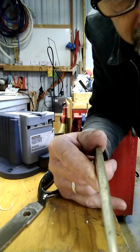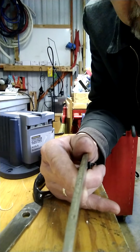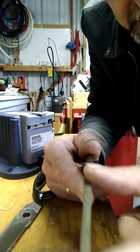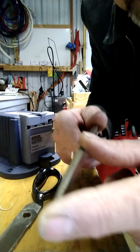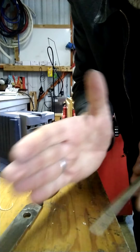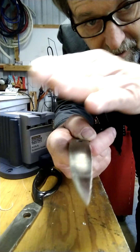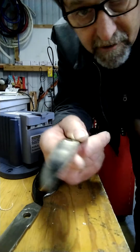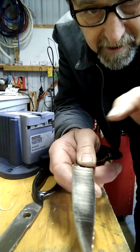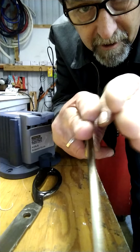I want to show you a little something about scissors. If you look, they're not exactly straight - they've got a little curve to them. As it gets out onto the end they're a little springier, a little thinner, so if they were straight they wouldn't cut anything the last little bit. Sometimes that curve gets straightened out and then you've got to whack them with a little hammer to give them a little bit of a bend. Also they're actually kind of concave a little bit on this surface, and that helps keep that edge nice and sharp.